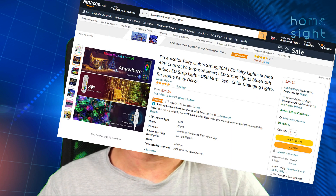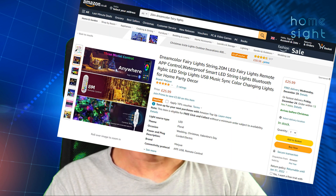I've come across some of these addressable LEDs - you see them on Christmas trees and they look great. They're powered by USB, they're really simple. However, we obviously want to be able to integrate them into something like Home Assistant. If you haven't heard of WLED, it's a really simple and great bit of software that you can run on something like a WEMOS D1 Mini or a NodeMCU. It gives you fantastic control and is very integratable into Home Assistant.